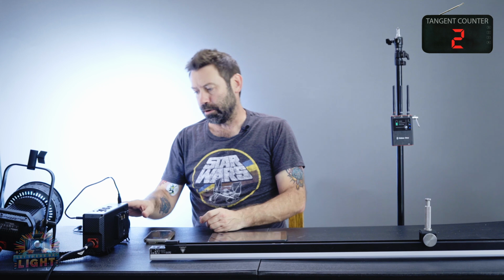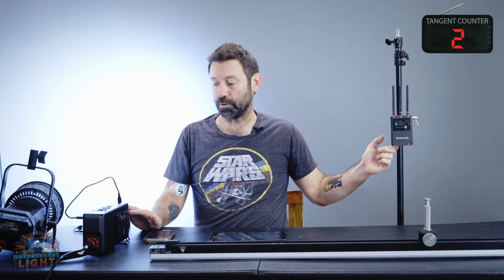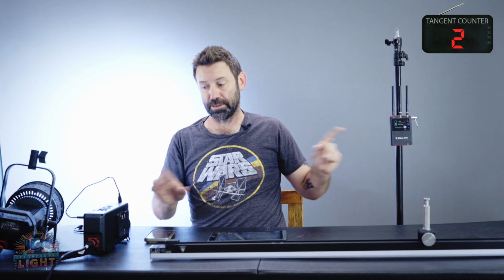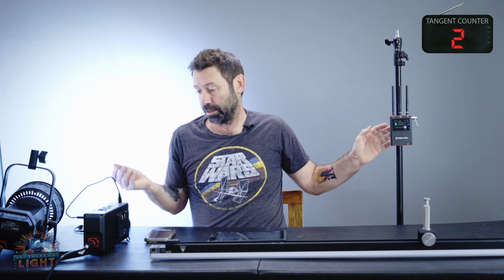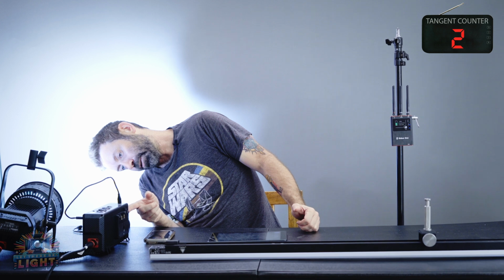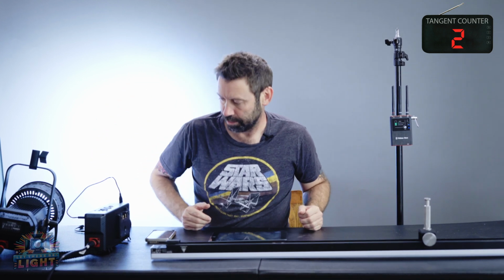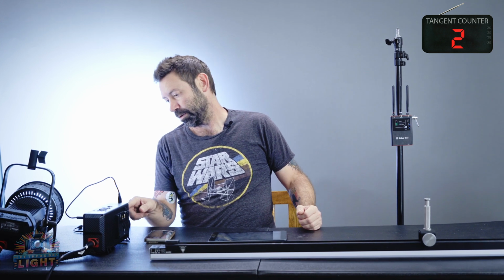Now on a SkyNode, again, if you haven't paired to a box before, you may need to hit a little sync button on here. It tells it to handshake. If you've used it with the same box before, most likely you'll just plug it in, it'll find it automatically. Should turn blue and have green as far as status indicators with a little blue flashing on the status, which is what mine has. Can hit the sync button. I'll go ahead and do that now.